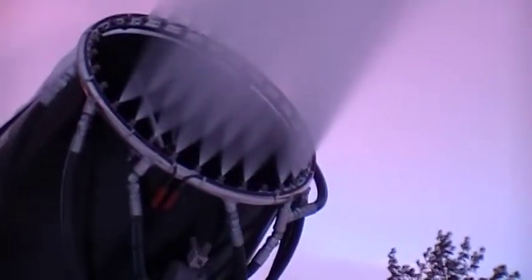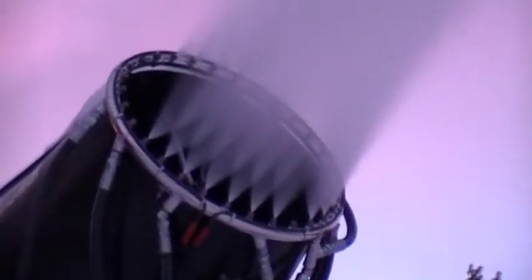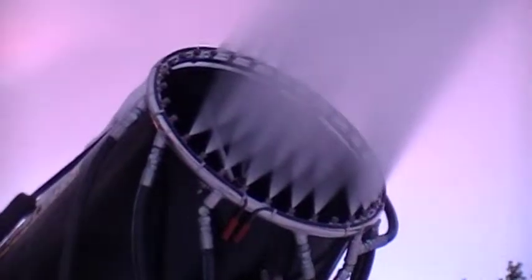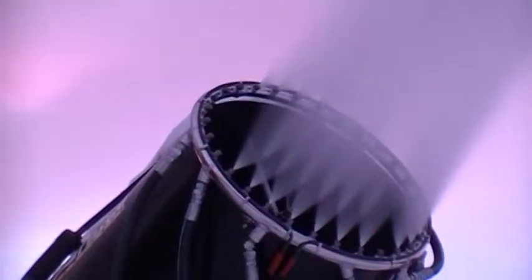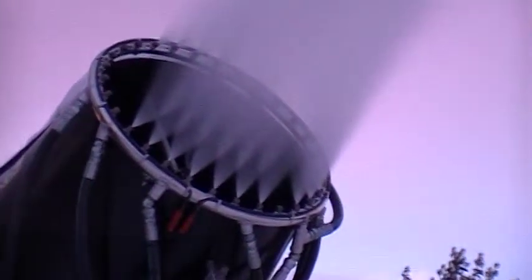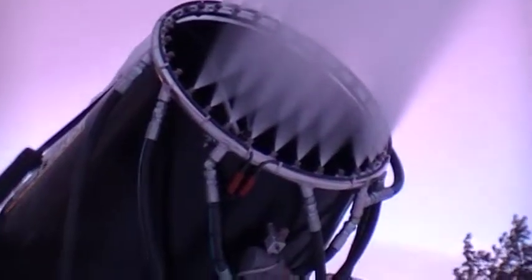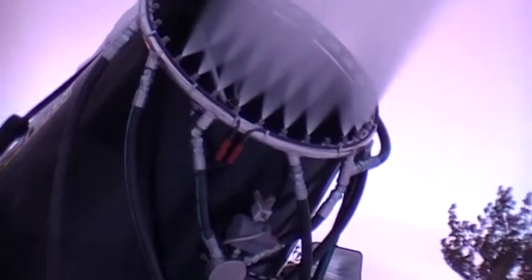You can see there are more nozzles running. One of the interesting things is the nozzles are in different sizes depending on where on the gun they are. The ones at the top are actually larger nozzles — they're pushing out a bigger droplet, which, thanks to gravity, drops down in, hits that nucleator, and gets whirled around through the fans.